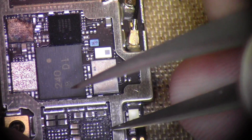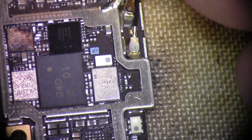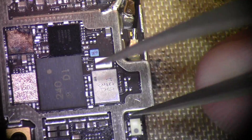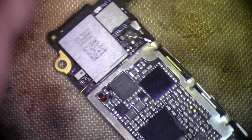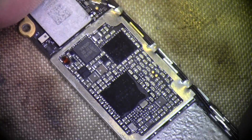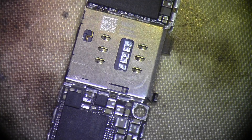Tigris here will have to be replaced - those chips have to be put back on before the phone will boot. That's how I go about looking for shorts on liquid damaged boards - or even non-liquid damaged ones. If the phone's got a short on it, that's the way I look for it. Hope that helped guys.